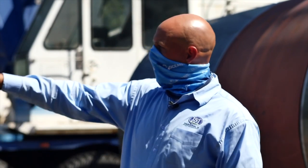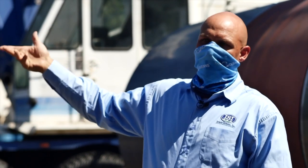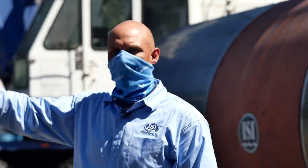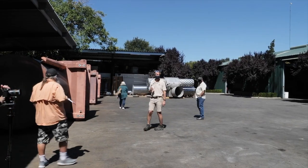And then this screen that's set up over here, we just got done welding all that this last week. And so I was like, well, we got people coming over, let's get it set outside. And what that is, is a screen with a finer slot size. It's 1 millimeter slot openings. And so that's a little bit tighter on the wedge wire.